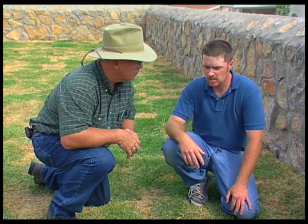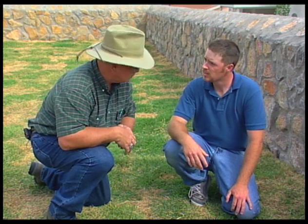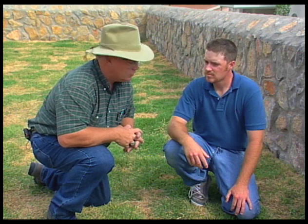And how long do you run the system for? To establish the turf, I'm running it quite a bit, 20 minutes 2 times a day with 1 hour every third day. Okay. And once the turf is established, I should only have to run it 1 time a week with the 1 hour. Okay. Well, we'll keep abreast of the project here, so we'll keep coming back to see how it's going. This is a system that is widely used in Europe and starting to come to the United States. We do have a couple of irrigation companies here in town that are installing some turf areas with subsurface drip, so it is something that can be done.